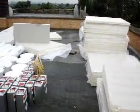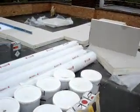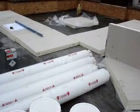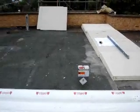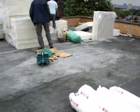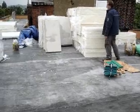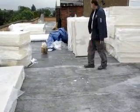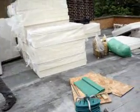Just here on the left hand side you can see the glues and the EPDM rolls ready to go down. Just in front of me there you can see how we have started the layout and you can see there are two or three layers of insulation on top of each other to make the falls. So at the back part here, to the right hand side, we are going to end up with nearly four to five pieces of insulation on top of themselves, working across to just where this gentleman is standing where we will only be one sheet of insulation.